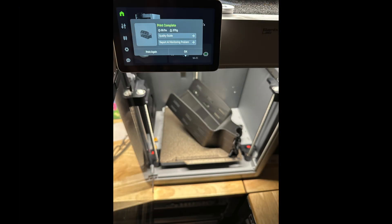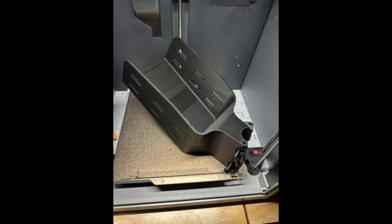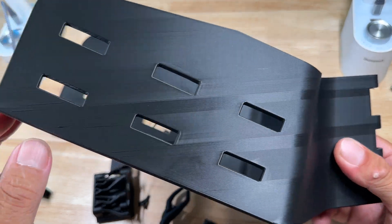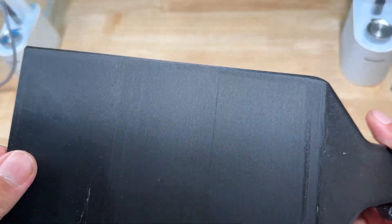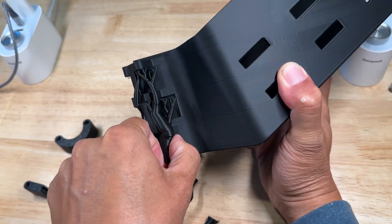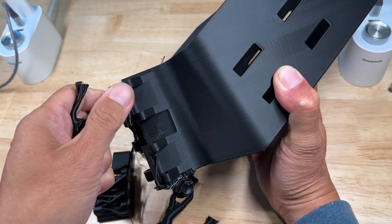This is the orientation that I printed the part. I wanted the latches to be the strongest part, so I printed that flat — the rest of the part is kind of hanging in mid-air, but it still printed okay. The layer lines look a little worse on the unsupported end of the model, but it looks okay. I used tree supports to support printing the hinge, but the slots for the Velcro straps didn't need tree supports because they were printed at an angle.